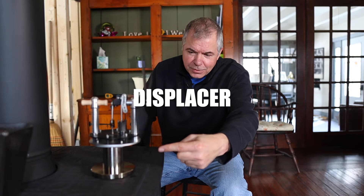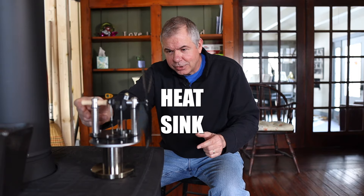The bottom has to be heated by a heat source — in this case, the wood stove. This particular model has to reach 215 or 250 degrees Fahrenheit to work. The heat coming up from the bottom pushes a displacer in the cylinder, which pushes a rod up and turns the crankshaft. The aluminum heat exchangers keep the top of the engine cooler than the bottom, then a small piston pushes the cooler air back into the displacer, making it go back down. It's a continuous cycle — as long as you have heat, it runs, and it's virtually silent.